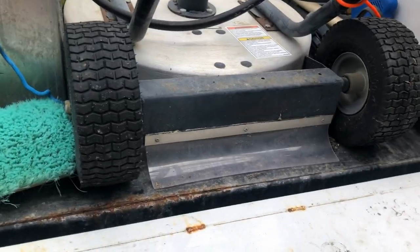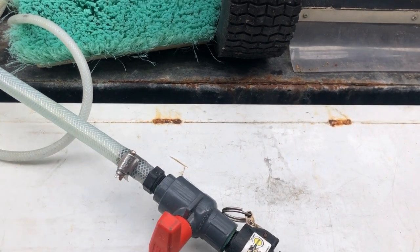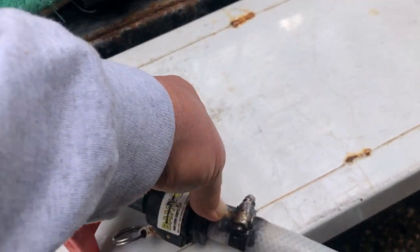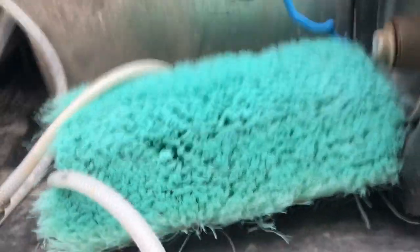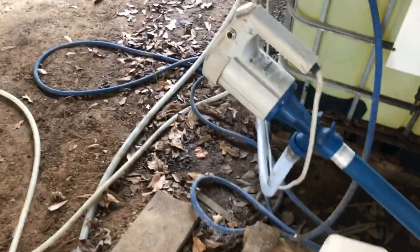Once the water is going through and it's all the way to the tank, I turn the pump off and turn my ball valve off — because if you don't turn the ball valve off, the bleach will start leaking back through. Then I take the banjo fitting apart and get the hose off. Once I have that out, I take this end of the hose — my inlet — bring it back over and stick it back into the tank. Then I turn the pump on and let the water recirculate through that tank. I don't throw it in the yard like I used to — I can just recirculate the water, which saves me having to refill this tank so many times.